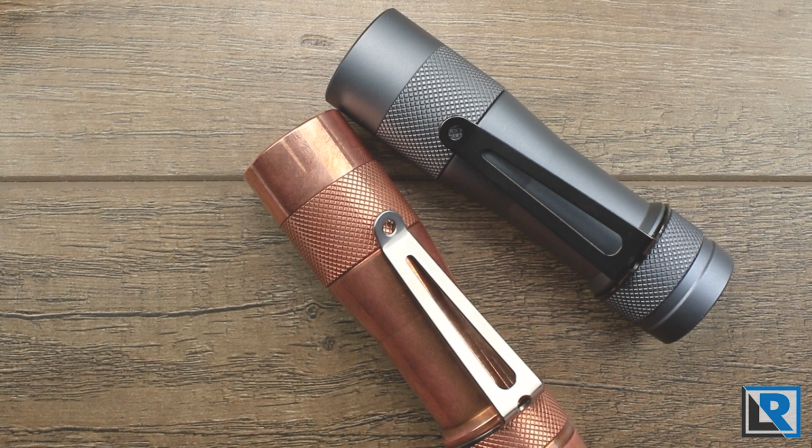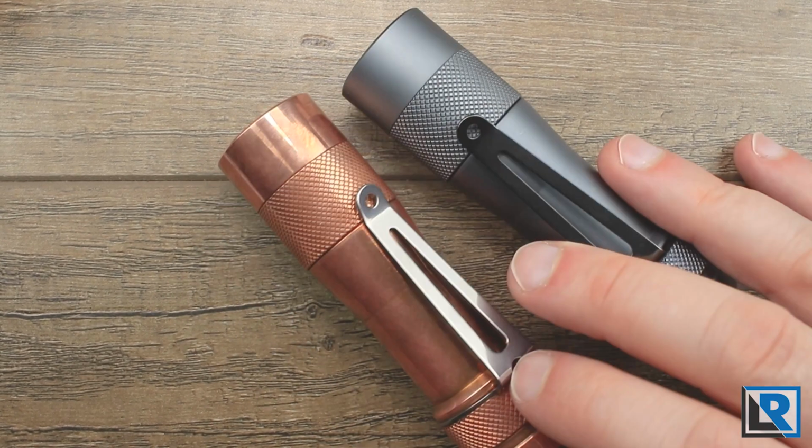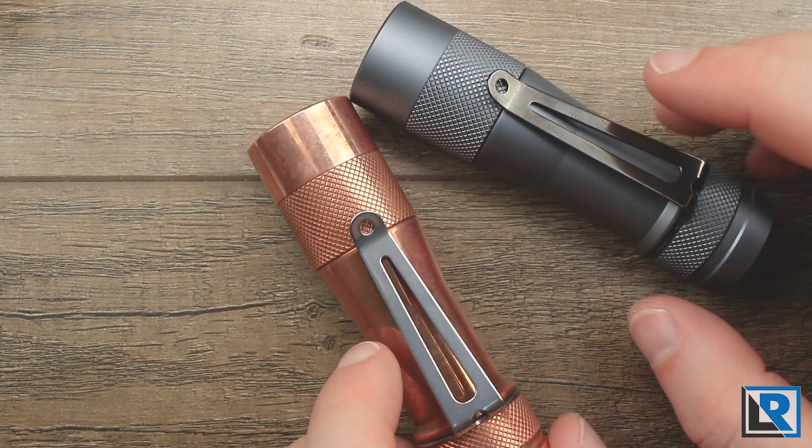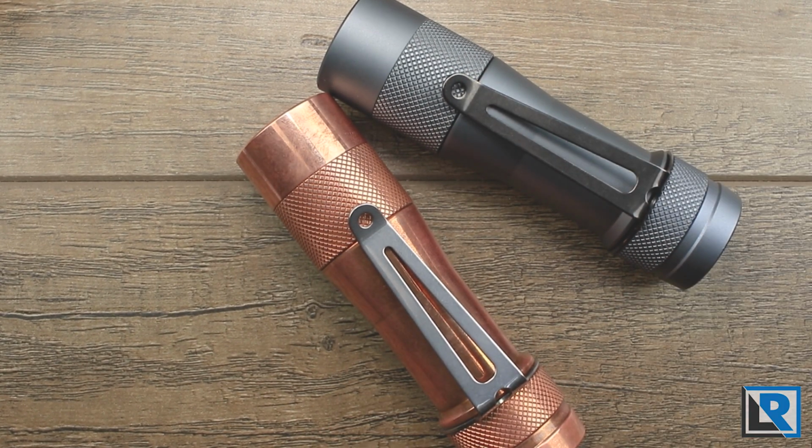That said, your battery here matters quite a bit too. You definitely want to be using a high drain battery, something easily capable of 12-15 amps is sufficient. The light does have low voltage protection on board, so running unprotected batteries is fine and recommended for best performance. But in my testing, I couldn't get an exact voltage because the light runs in such a low output mode when the battery power gets low. I ended up shutting it off after 12 hours because the battery is still going.